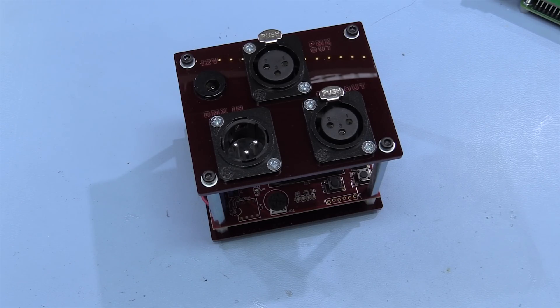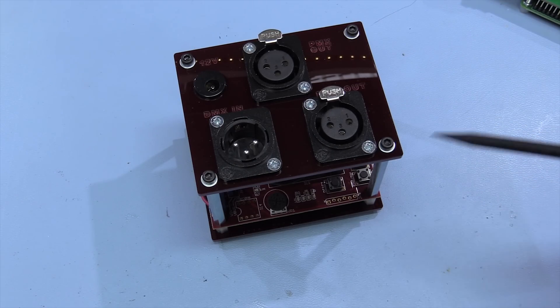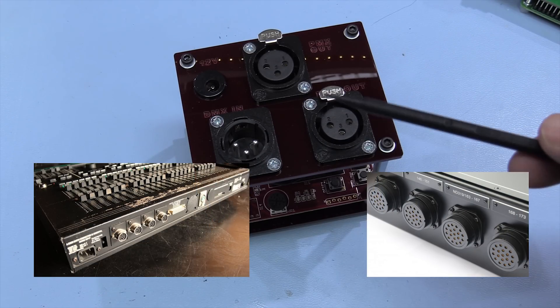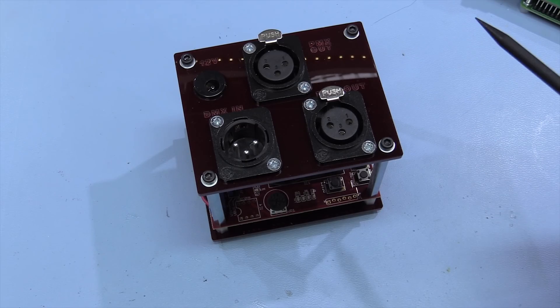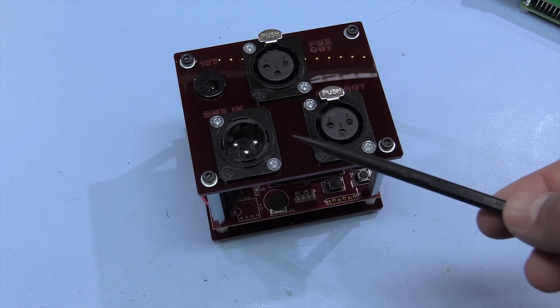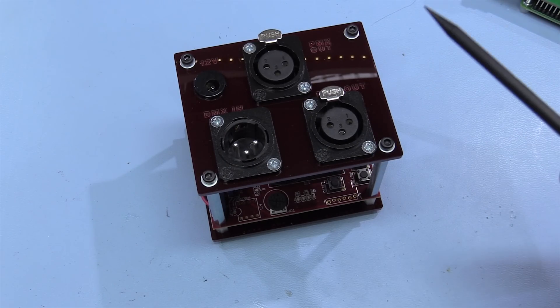These lights are from the late 80s or early 90s, and at that time the standard way to control theatrical lighting was through an analogue interface — lighting desks had a bank of zero-to-ten-volt analogue outputs, interfaced with intelligent lights or dimmer packs for incandescent lights. These days there's not really much gear that uses analogue control; the standard is DMX 512.